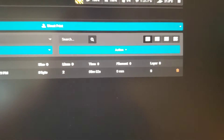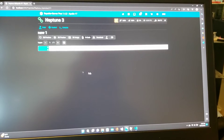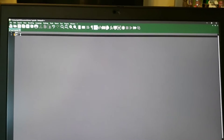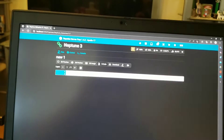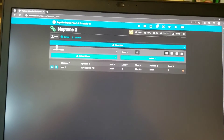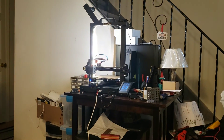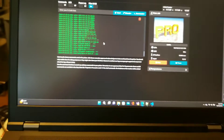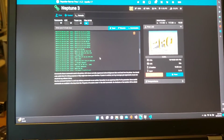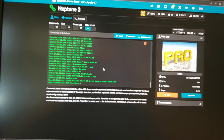And there we have it folks — eight minutes and two seconds. So I'm going to modify the code and put in S12000. Looking at the console output, it took four iterations that time — that's why it took eight minutes instead of seven and a half. Now I'll modify from here, put in S12000, back to the print screen, cycle start, let it rip.